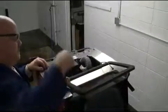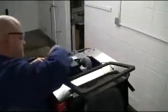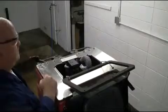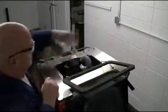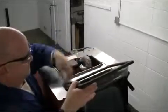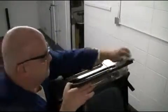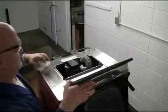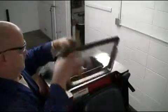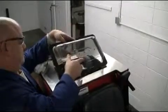When this is complete, lower your recovery tank lid and open the clear recovery sight dome as demonstrated here. Clean the seals and the lid bead and clean the sight dome accordingly. Note: it is important to make sure that when replacing the sight dome that the two chain lanyards are properly stowed inside the recovery tank to ensure that the sight dome seals secure properly to the recovery lid.